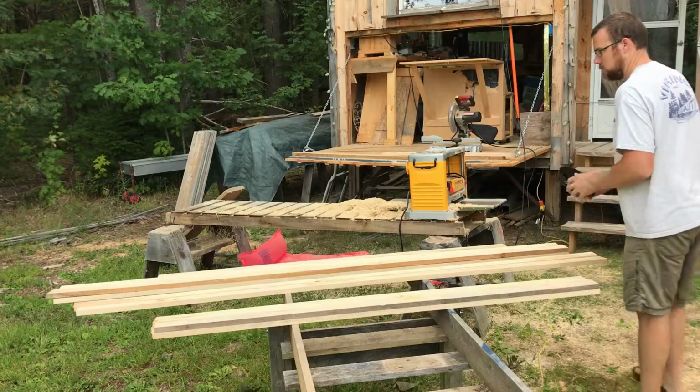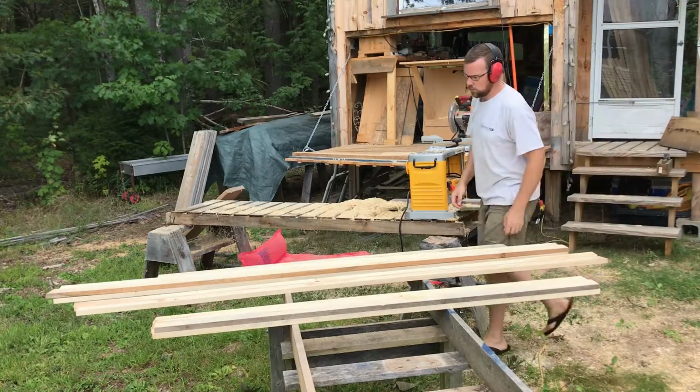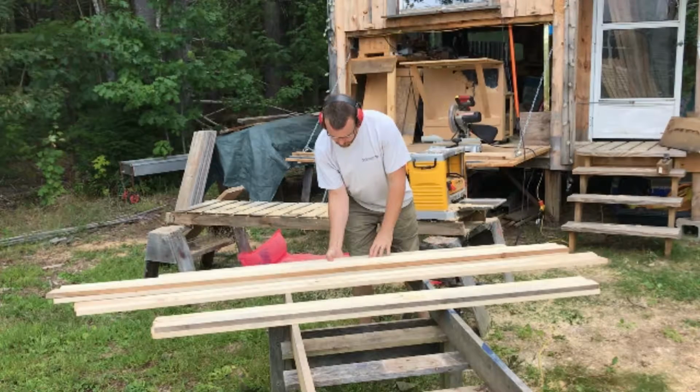First, you need to develop a way to know which sides you've planed and which you haven't. When you first begin planing a board, the first few passes are easy to tell. But the closer you get to finished, the harder it is. I repeat 3 words in my head in the same order each time. Flip, plane, place. This is the order in which I take the steps.